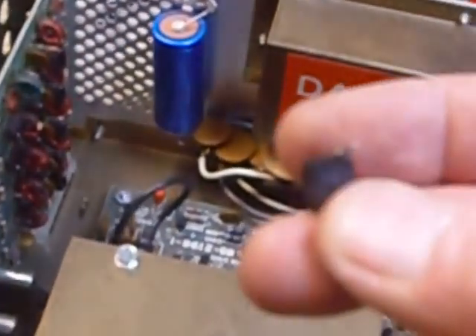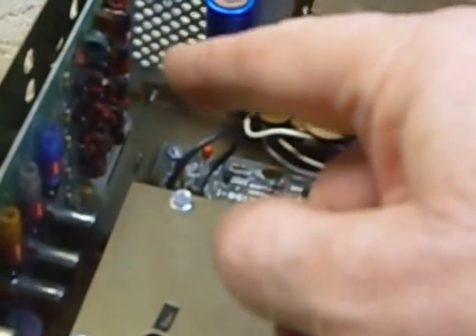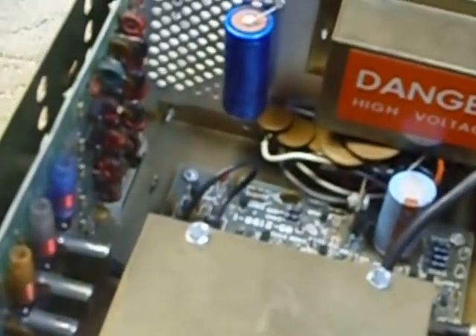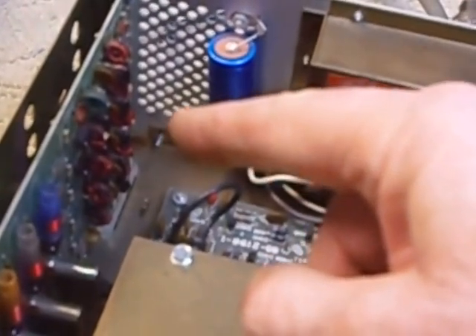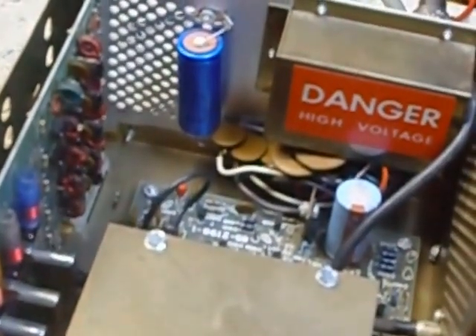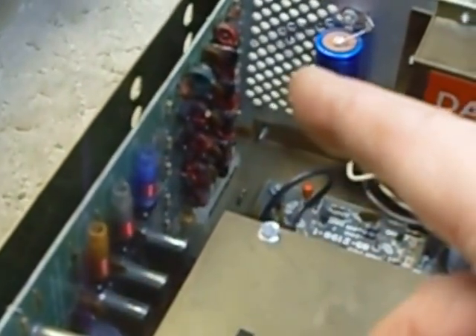Those replacement capacitors were rated at eight picofarad like the ones I took out, but the frequency was still high. So I had some two picofarad capacitors, and on the 15 meter and 10 meter adjustable capacitors — which were two to eight picofarad — I put a two picofarad capacitor across each one, and then those tuned beautifully. You have to be careful because you can tune the 10 meter coils to 38 megahertz, which is five megahertz above the crystal frequency of 33, but you want to tune it to the lower side at 28 megahertz. I checked that with a frequency counter — it took me a while to figure that out.